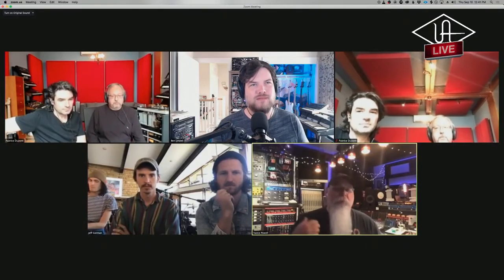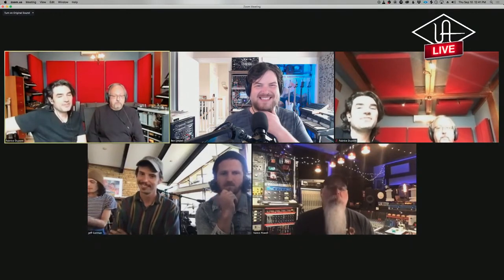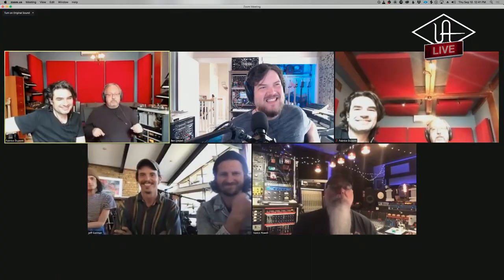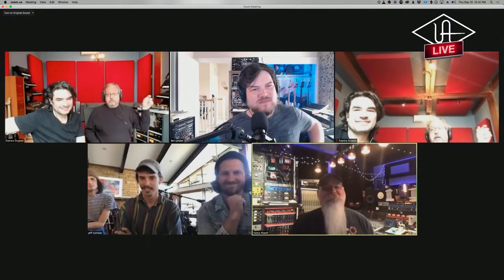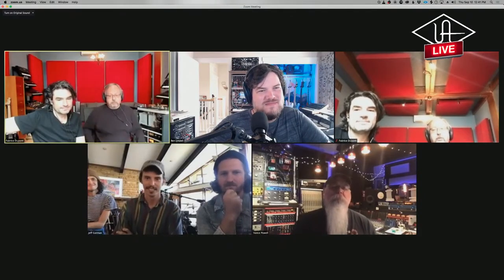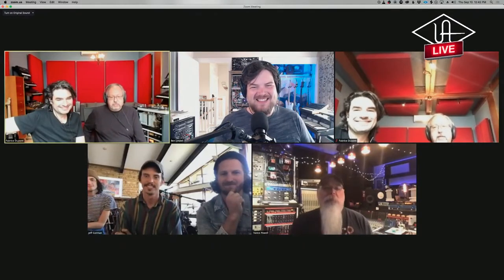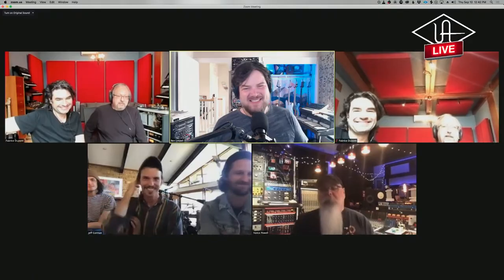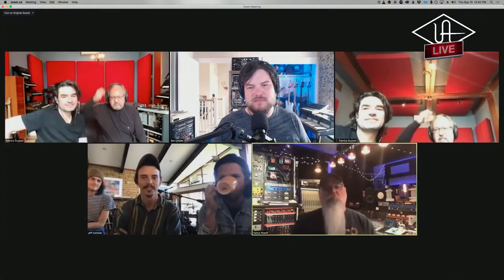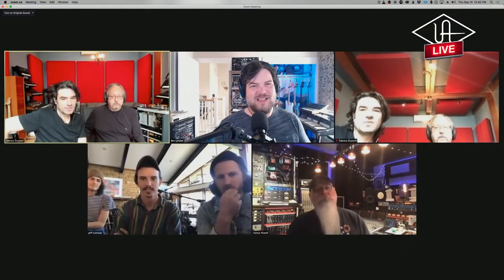I never do 30. I always do 15. But he likes 30. Like you, I like 15. I'm a 30 nerd because of distortion, I like the slightly less intermodulation distortion. Absolutely. But the flux heads reach way down to 20 hertz at 30, so I think that gives you the best of both worlds. That is cool. I should set mine up for that. Don't change what you do, Vance. Yeah, I do zero at 250. So zero over 250, so plus 3, 185. Nice. That's great.